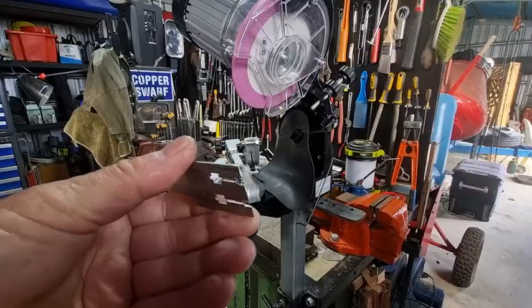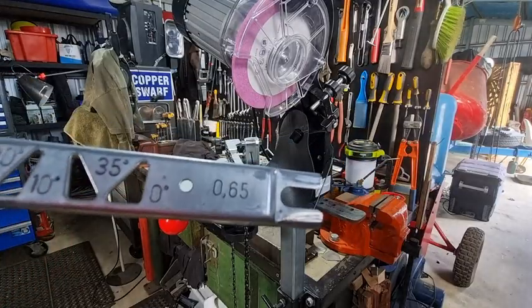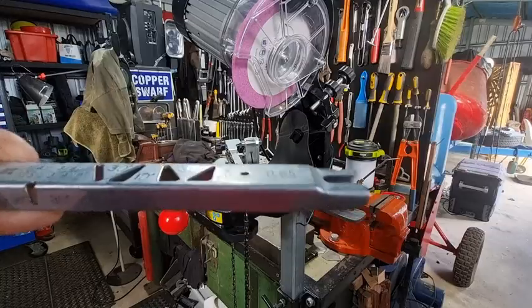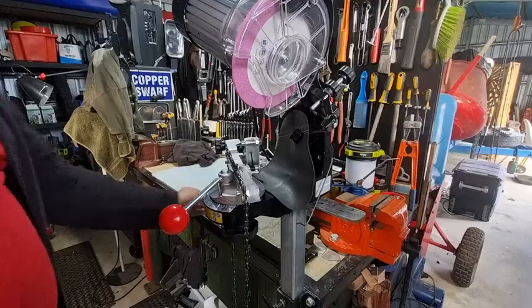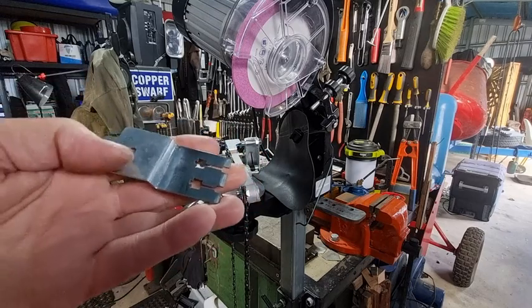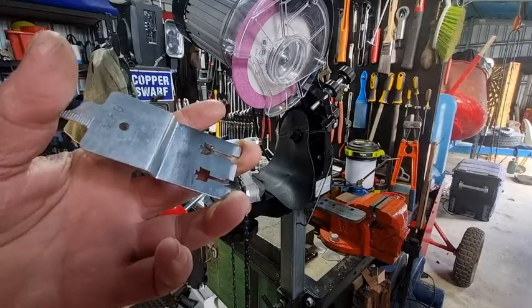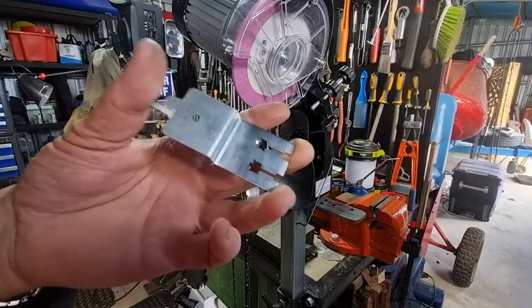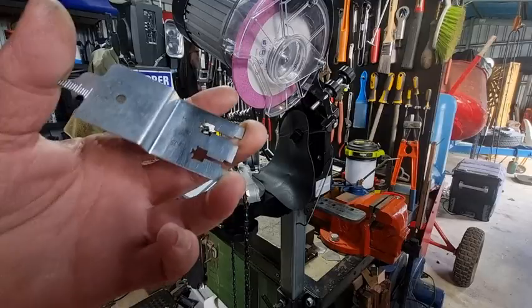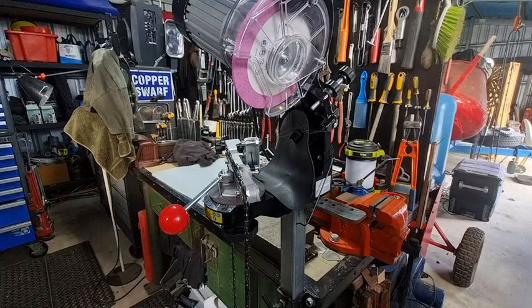The different the tooth length, the different the raker height will be — and that's why these are superior. These were invented by Ray Carlton in the early 60s. The constant depth gauge was invented by Joseph Cox of Portland, Oregon, and it had a worldwide patent in the early 50s, and nothing's changed from then to now — they still sell that type of gauge. But the progressive type is the one you should be using. For those here in Australia, you can get it from your local Stihl dealer or Husqvarna dealer. If you're over in America, you can get on the West Coast Saws website and order a progressive depth gauge online, or go to your Husqvarna dealer and get the Husqvarna one.